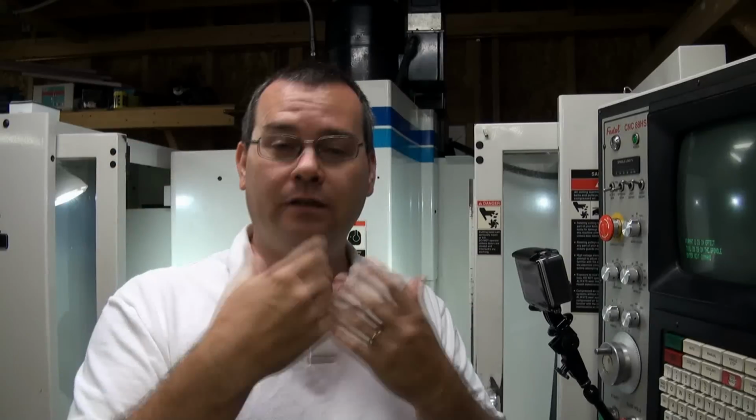So today's computers are so fast that they can easily overwhelm these machines with data. So the machine will yell at the computer and say, oh, stop, stop, stop, slow down, I can't take the data that fast while it's processing the data. And then when the machine's ready to receive more data, it will say, okay, you can send more, and then your PC will send more to it. The USB interfaces mess that up somehow, and I'm not entirely sure how it gets messed up, but very few of them actually work. So you really need to find a computer with a native hardware built-in serial port. That will work. So that's step one.